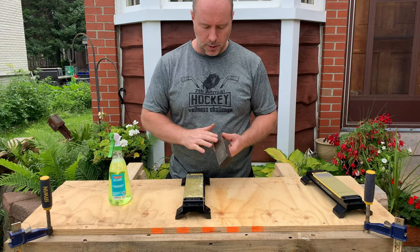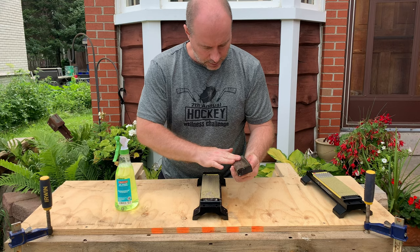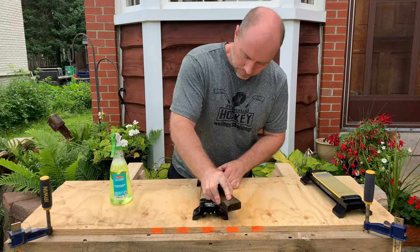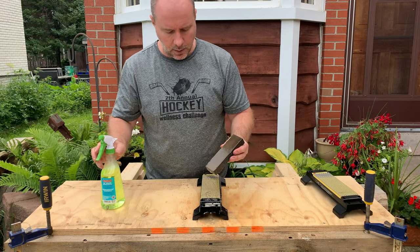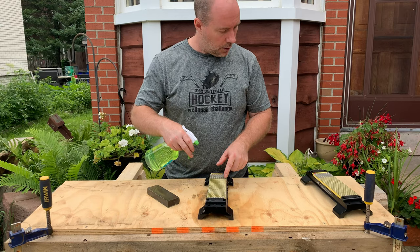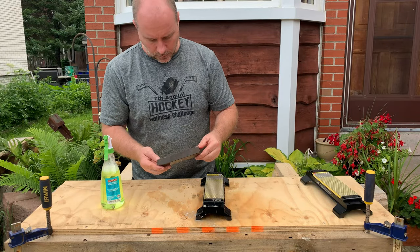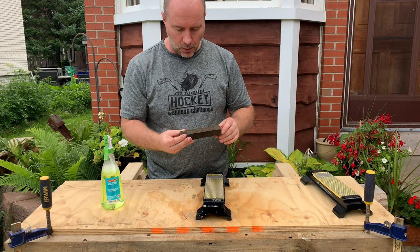The reason we're doing this is to make sure that there are no curves in the stone. I can see there are a few flat spots, so I'm just going to keep going with it. Actually, this stone is not very bad at all. I'll do the other side — it looks like it's evenly scratched all over as well, so there are no real dips in it. I'll start with the coarse side now. Yeah, it certainly does look way better. I think it's probably as good as I need to get it, so we'll leave this one alone.